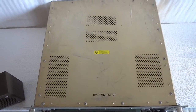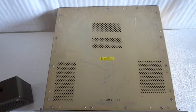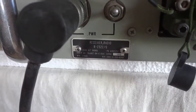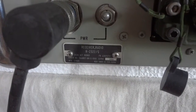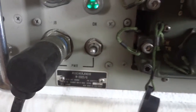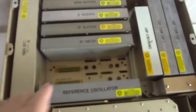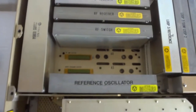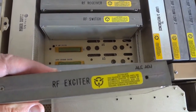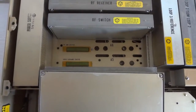As I said, built to withstand World War III, literally. Here you see the bottom with the bottom cover installed, completely covered. The R2322G is the same chassis as the RT-1512 — looks exactly the same, with the exception of these two modules for the transmitter that have not been installed for the receiver version. I do have one module — that's the RF exciter — that would go in here. Would have to remove that tape, but for the rest it will fit perfectly.